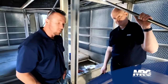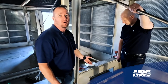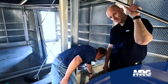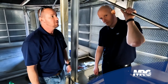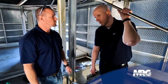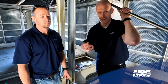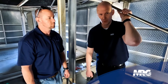What we have to fix inside this tower is the crossover section, which allows the cold water basins to equalize between the two cells. They used improper hardware — it's supposed to be stainless steel bolts, stainless steel nuts, stainless steel washers. They put some galvanized hardware in the bottom and it rusted out, causing leaks. On one of the other flume boxes they didn't even have the seal tape that goes all the way around — that gets bolted in just like the fan section and basin section to make a watertight seam, because there's a lot of water pressure. This needs to be basically a watertight swimming pool.